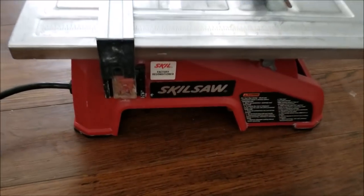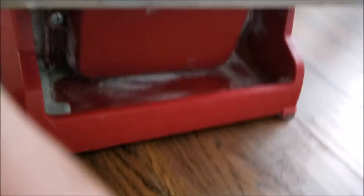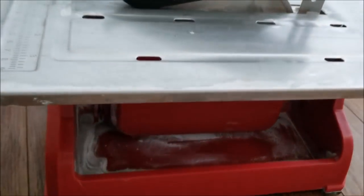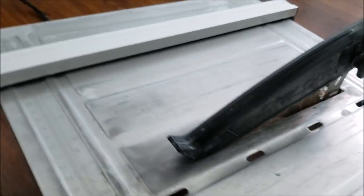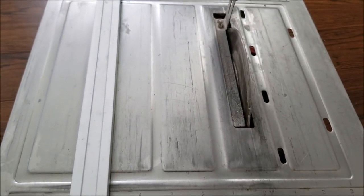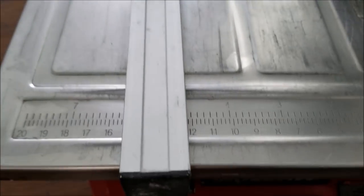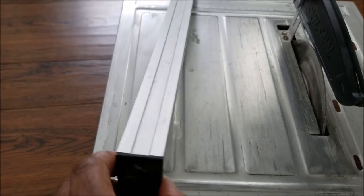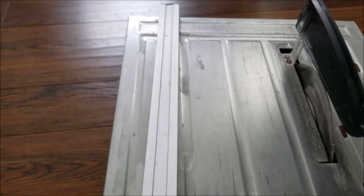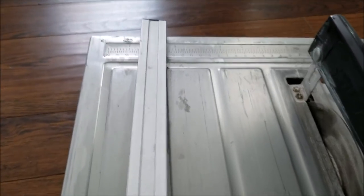Now in terms of cutting the tiles you do need a wet saw. I have this tiny little one here that I bought refurbished a few years ago — it was really cheap, like sixty dollars. There is a little receptacle for the water on top. There is where you do the cutting — that's the blade, which is usually covered. It kind of guides the water to drip onto the tile to keep the dust down. That's the wall there, which is removable — you can slide it back and forth depending on the size of your tiles.